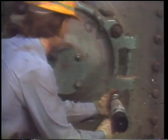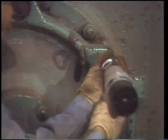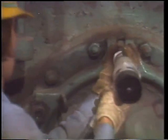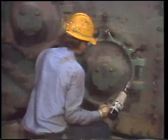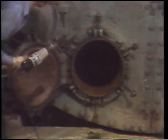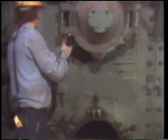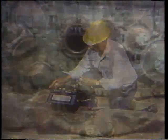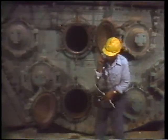With the water boxes drained and equipment tagged out, it's safe to open up the condenser. The impact wrench makes it a lot easier to open than hand tools. The large nuts are backed off only enough to allow the studs to be swiveled out of the way, and the door comes open easily. After opening two doors on each side of the water box, the very first thing to do is an air quality check — this is necessary before entering any kind of confined area.